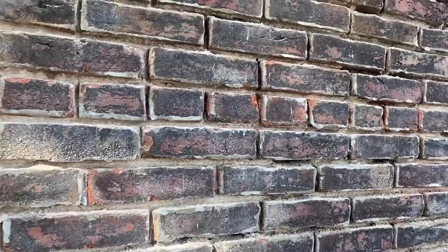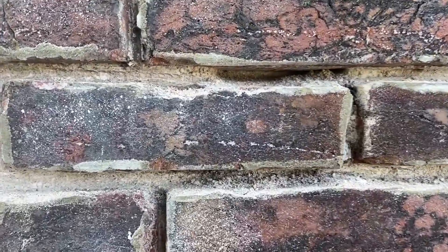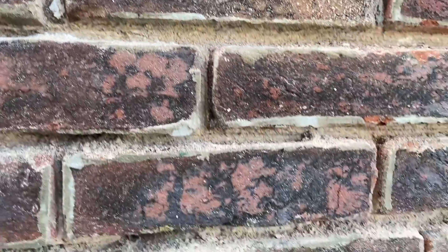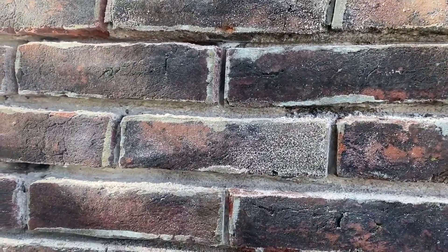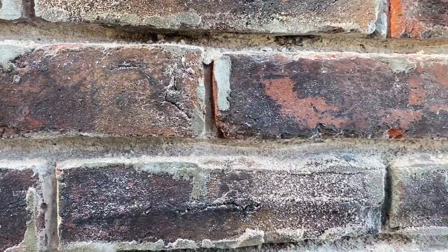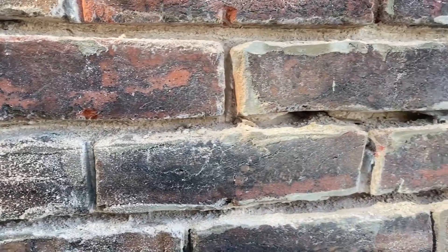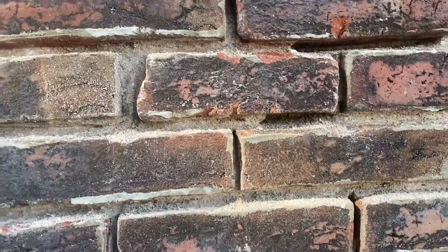You can see how we've been removing it. If you look into this wall here, you'll see these big voids. Because that cement was on there, it's trapping water in this wall and turning all this mortar into very soft and deteriorated lime mortar. It shouldn't have been this way.